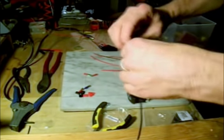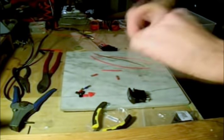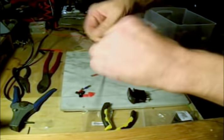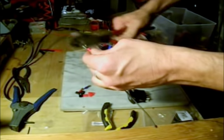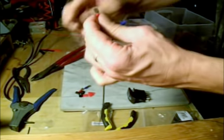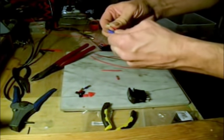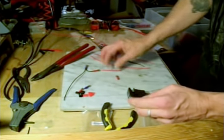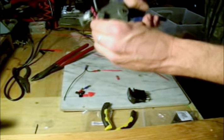On this side we can use one of the red connectors since it's not that long. Trim them down a little bit, pop them in and give it a small punch. You don't need to push these a lot — just enough to pinch the wires on the inside. You don't have to mash them beyond recognition. This is a case where more is not better.